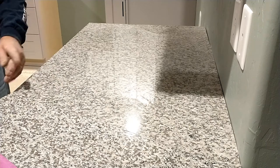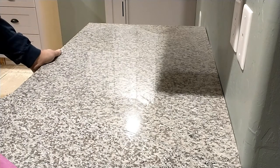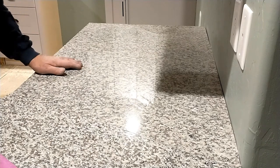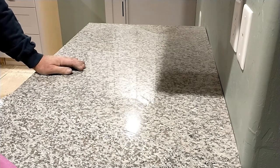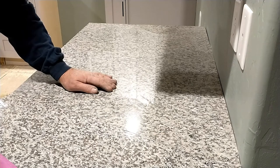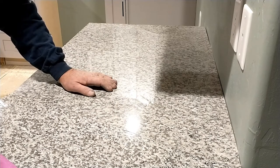A little more on these countertops: I found a material supplier in a major city that sold these — they're known as prefab countertops. They have a finished edge on two edges, one long edge and one end, and they're cut to 26 inches in width, so they fit on standard cabinetry real nice. All you have to do is cut your miter seams. I accomplished that with a skill saw fitted with a good diamond wet blade, and I took a small aquarium hose from an aquarium pump so it would put water right on the front of that blade. I took a lot of precautions to not get shocked — using a GFI breaker, keeping the water out of the motor, and keeping the electrical cord up out of the water. It was definitely a two-man job.